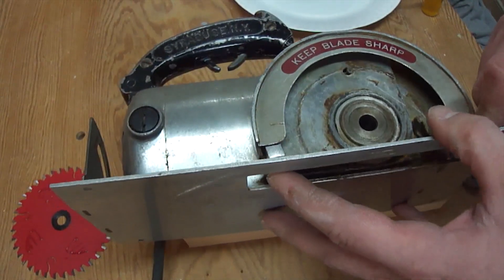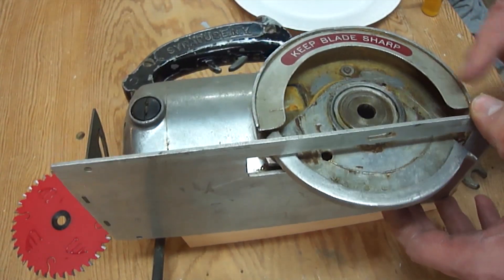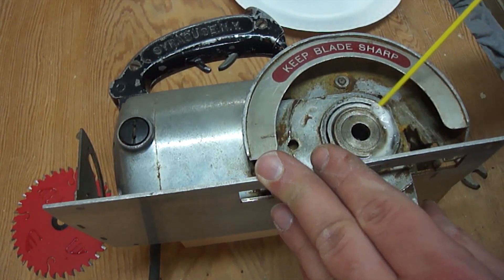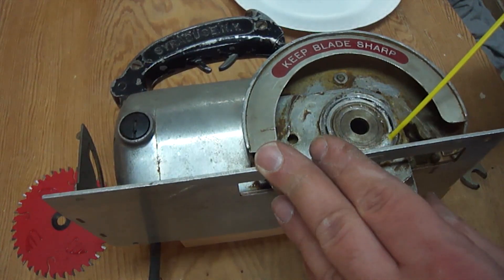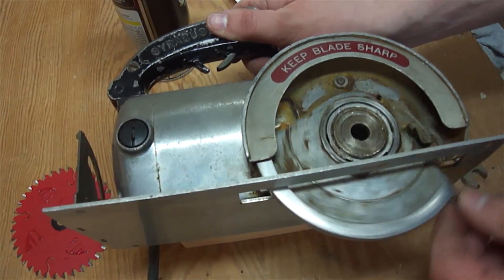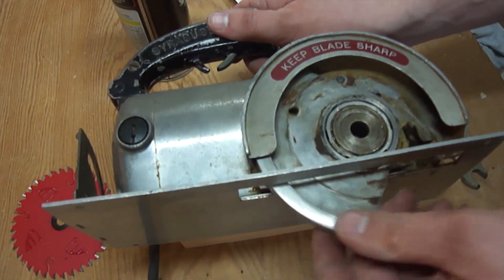To release the guard again, you just push the pin and it pops out of the hole — back to normal guard operation. To get it working a little better, for moving parts on tools I like to use spray silicone lubricant. Once the liquid part evaporates — and it evaporates pretty quickly — what you're left with is a film of silicone that doesn't attract dust. If I used an oil-based lubricant, sawdust would get into it over time and I'd be haunted by it forever.